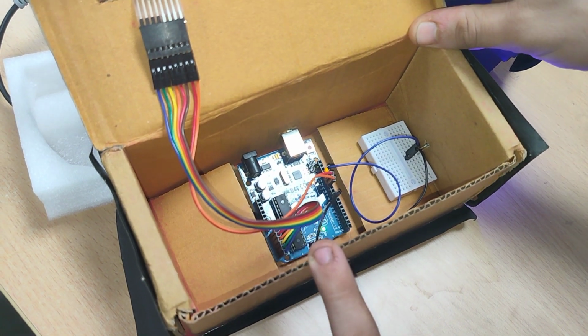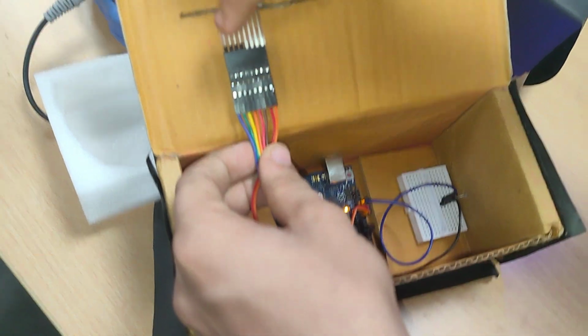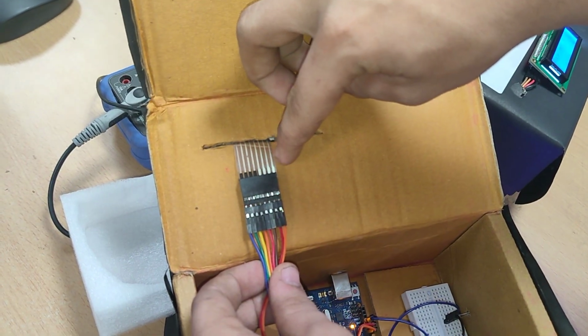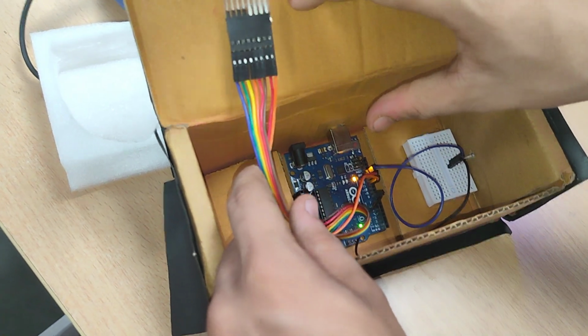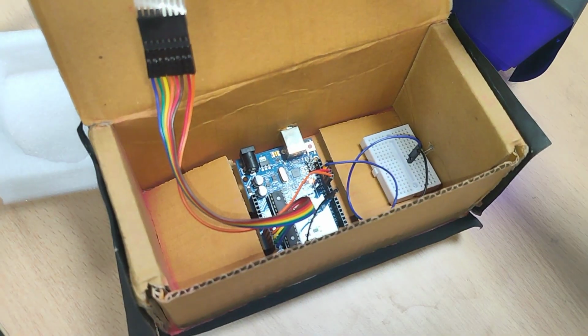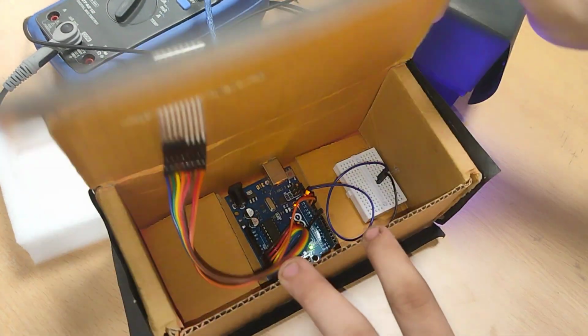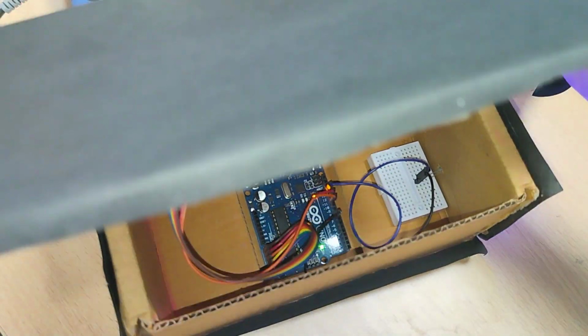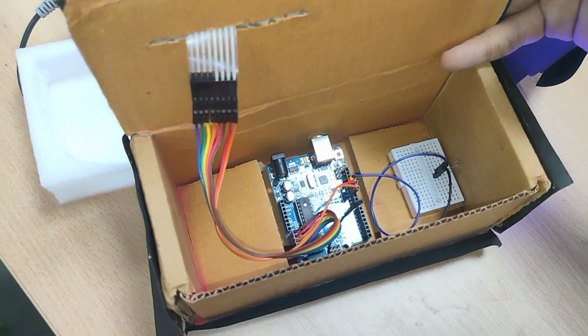So these inputs are basically the column pins, which are the black ones, and the row pins, which are the white ones. And now these are connected to this Arduino, whose code detects what character is being pressed. Based on which the Arduino code takes the characters, like 1, 2, 3, A, any of these, and turns them into their ASCII table values in binary, which is the zeros and ones.